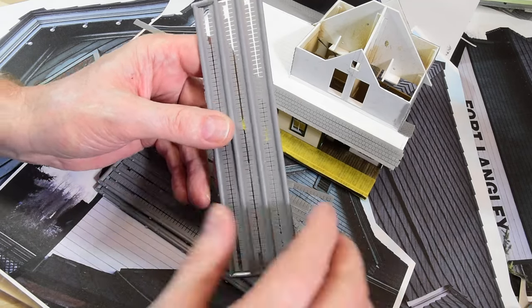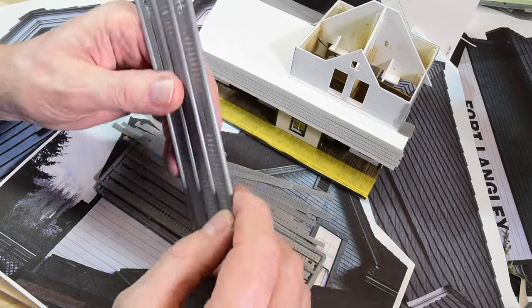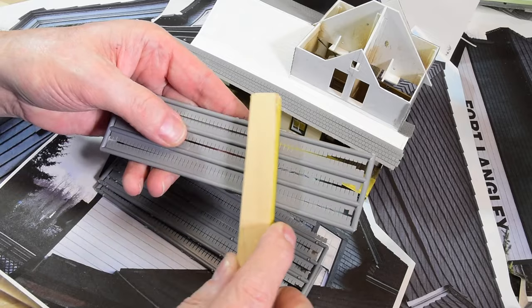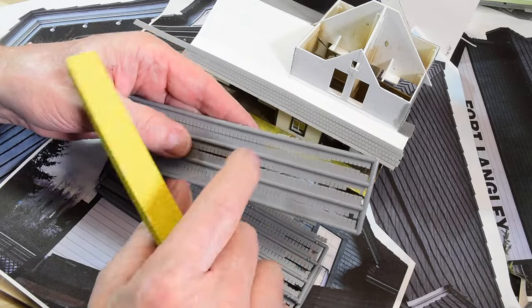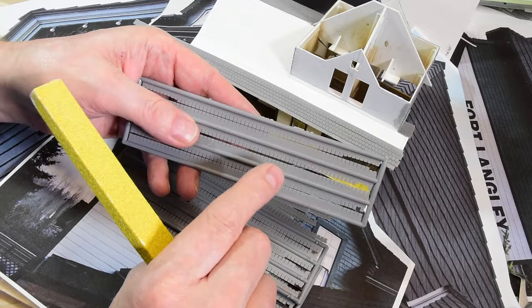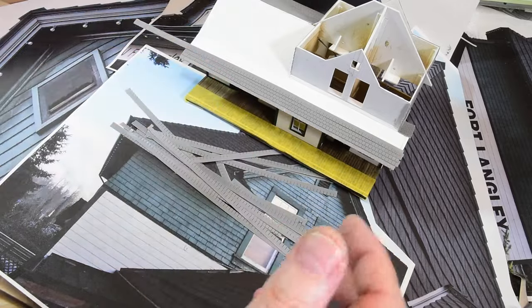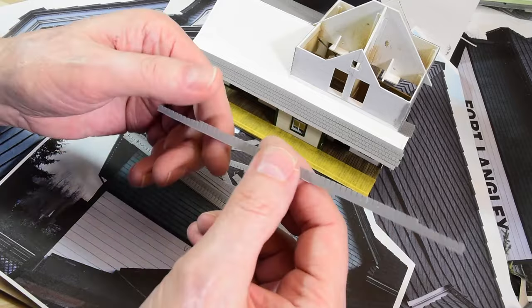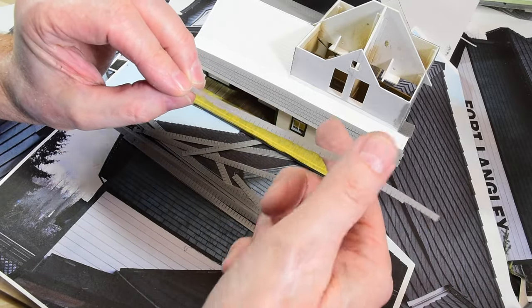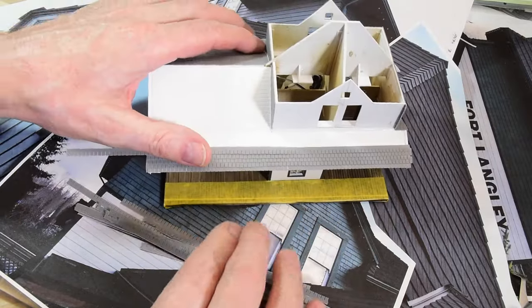So, they've mounted them on there because that's the way they're molded. And then I stroke them, just the backside, with a bit of 60 grit, because it helps the solvent, makes it more aggressive. You get a better bond when the solvent hits a grainy surface. So I just cut a whole bunch into strips like this, okay?